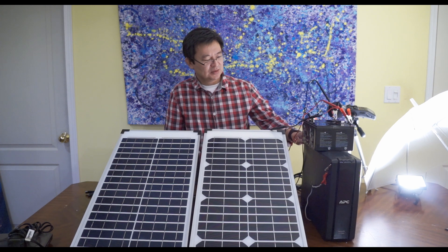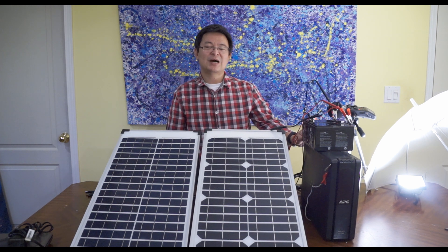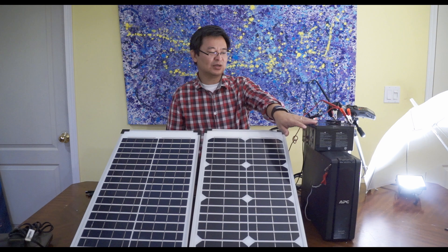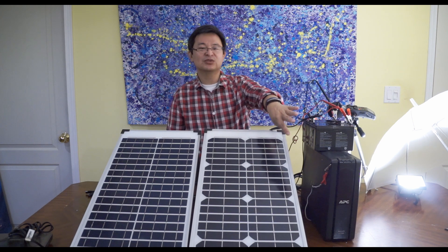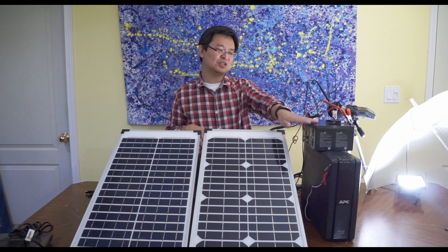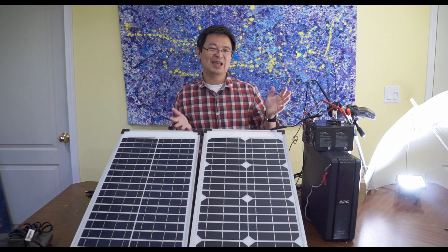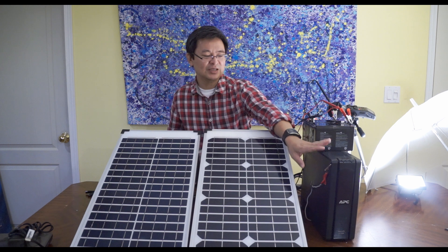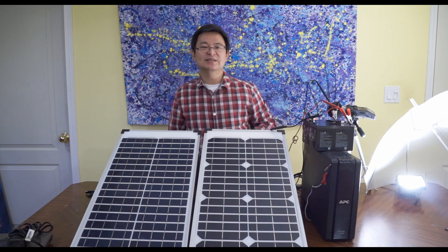Next time I'll show you why you want to use a 24 volt system. As you can see, I have a UPS battery system that you normally plug into your computer, printer, and other devices. I took a UPS where the battery was dead, replaced it with an electric bike battery, and rewired it so I can use these two terminal plug-ins. I'll charge this battery and hook it to the UPS, giving me energy out in the field — camping, laptop, fan. This 24 volt UPS system is really powerful and cool.